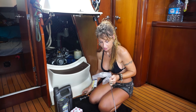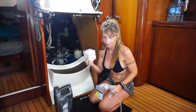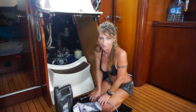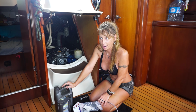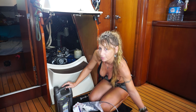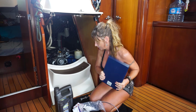Guys, today I'm gonna be doing the oil change and the oil filter change, because last time Nico was doing it, and we usually alternate, so he's doing one time, I'm doing one time. The engine is now 209 hours run since the last oil change, so we're 9 hours overdue, which is not so bad. We're usually keeping the information in our logbook so we can look up exactly when the change is due.